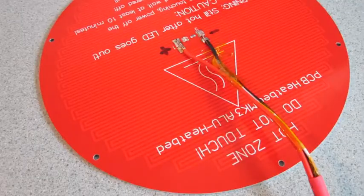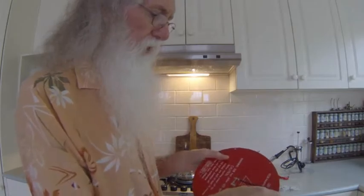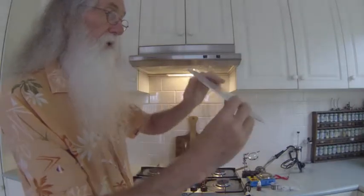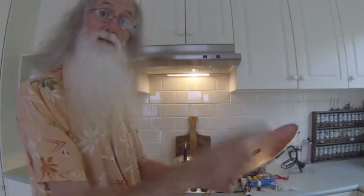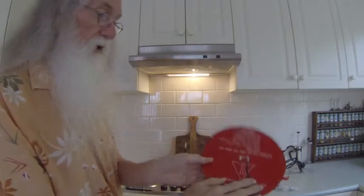There's a reason I've got the wires going upward: when it fits into the printer it will sit around and go back into the terminal blocks. If I want to remove the hotbed I can just lift it up. If the wires were going back the other way they'd have to cross over, because the negatives and positives need to match up so they don't cross.